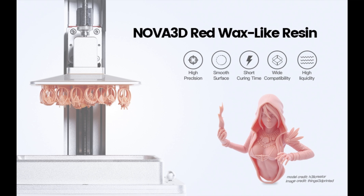Wax-like resin is an interesting material — it's basically a resin that prints almost like a wax. You can use printed parts in a lost-wax resin cast, putting the part into a mold and burning out the wax to manufacture metal parts, specifically jewellery and similar items. Because resins are a liquid, you can mix types together, using certain aspects of one resin to benefit another. You'd need to experiment and check online what works best to avoid mistakes.